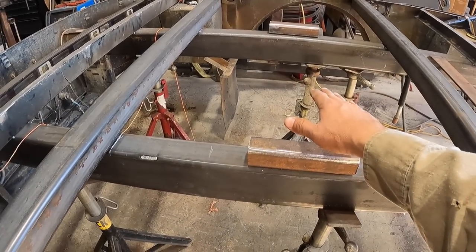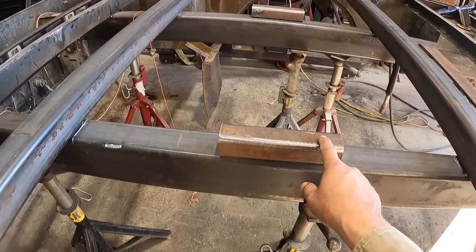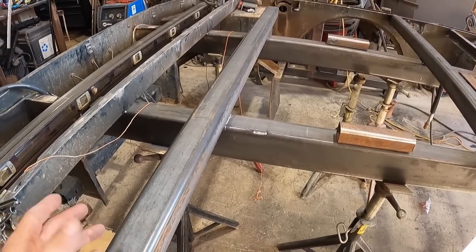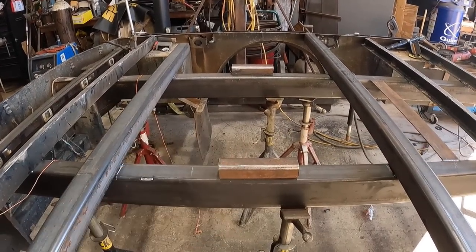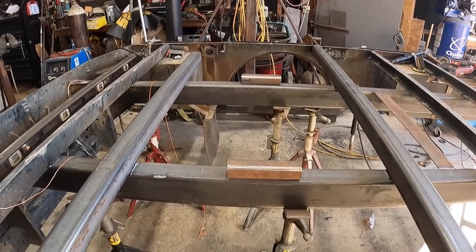We'll come set the blade on here. We're gonna tack these beforehand, so we will have some area to weld here. And then this one will be slightly adjustable in case it's slightly off. You know, within a 16th is fine, 1/8 inch. So that's our next step: put that plate in here, get it all tacked up, and get it welded. We're getting close, right?